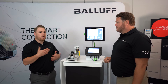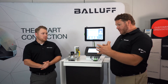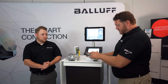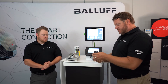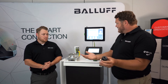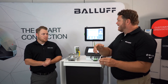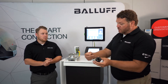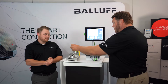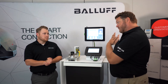This is a tool management system. Essentially, it's a way to make sure that all the tool data is managed in one place. There's an RFID tag buried in the side of the tool, and this is an RFID reader. The tool would come out of the presetter, all the measurements would be taken, and that's a critical component — the presetter is a measurement tool that can do very high-end measurements. Those measurements are written to the tag instead of on paper. We walk the tool over, set it into the nest at the machine, the RFID tag is read, and that information is automatically transferred into the CNC machine, right into the register.